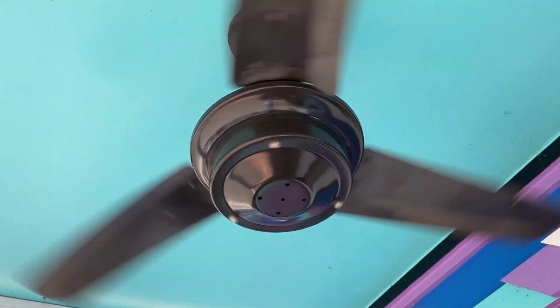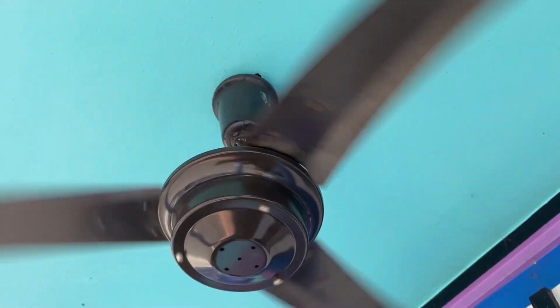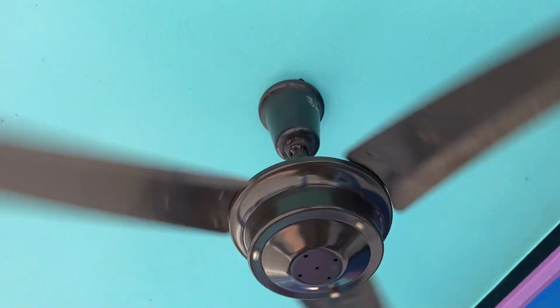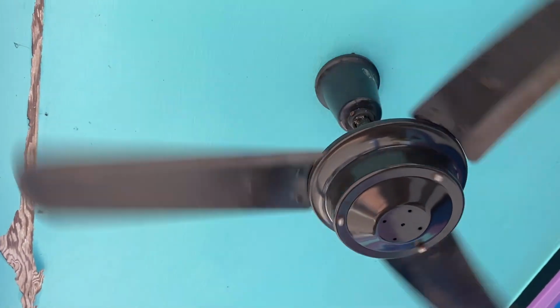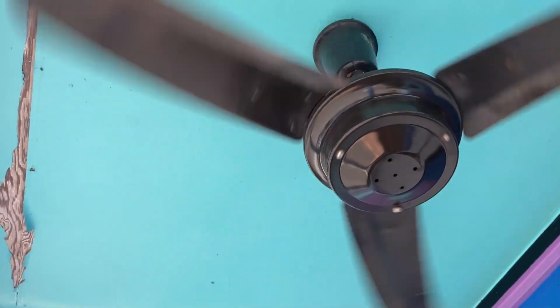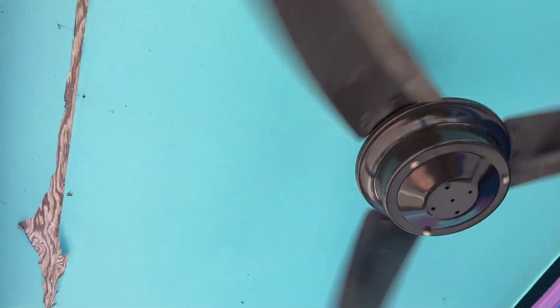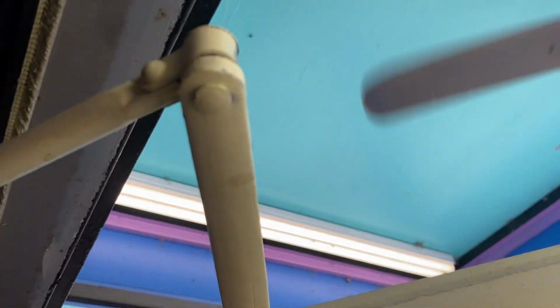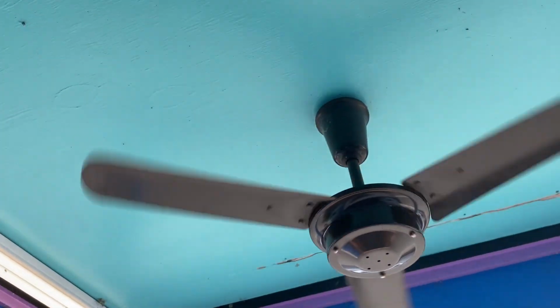I haven't got a full-size tat like this. A 52? Yeah, 56. It's like your tat that was here, except full size. And I freed it up from being locked up when I got it, because I got a total of 6. But it probably needs new bearings, right? Yes. If it was locked up, even if you free it up, they're still going to be noisy after that. So we'll turn that back off, and not damage the bearings anymore. They already are. That's right.